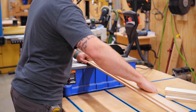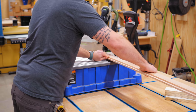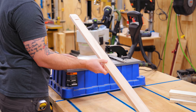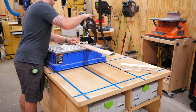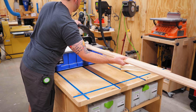Next, I needed to address how I was going to mount these trim pieces, and I decided to go with pocket holes. In my rush to get these pieces prepped for finish, I of course drilled a pocket hole on the show face of the trim — but thankfully this part was able to be removed, so the trim could be salvaged. I drilled pocket holes roughly every foot, starting about four inches in from the end of the board, and my Kreg Foreman really made quick work of this task.